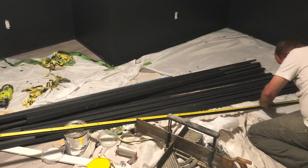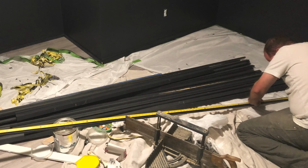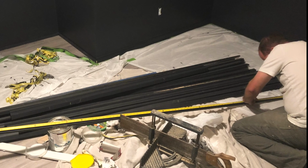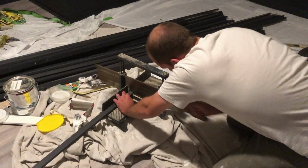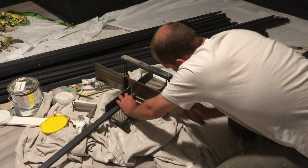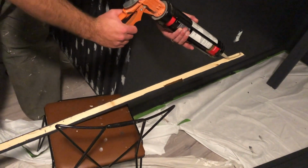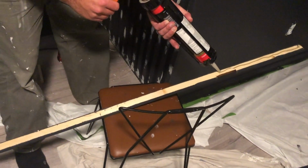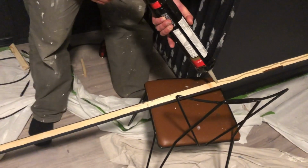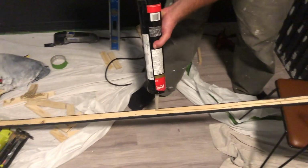When all of the paint was dry, we brought all of the slats into the bedroom to start putting them up on the wall. Walls are never square in a room, and since we wanted to measure each individual slat to get the right height, we brought a measuring tape and a handsaw to the room with us. Since we obviously couldn't put each one of these slats into studs on the wall, we put construction adhesive on the back of each of the slats to prevent any movement as it's getting nailed up on the wall.